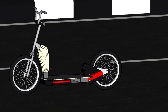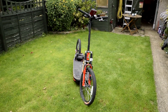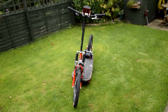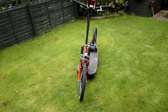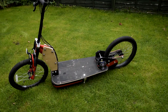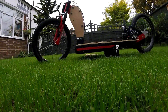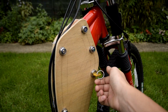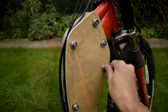It has a mainly steel but some plywood chassis, a fiberglass battery cover, and electronically removable motors so that the back wheel can freewheel. The handlebars have been extended to allow for standing riding. The front brake has been upgraded; there is no rear brake but the motors do supply some electronic braking. It has about 10 centimeters of ground clearance, which allows you to go over most speed humps and do some light off-roading. This key turns on everything including the relay controller for the motors, but no power gets to the motors yet.